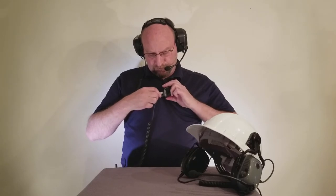Next we'll discuss radio mode. Boom mic placement is important for clear two-way radio communications. Press and hold the inline PTT button firmly to transmit audio and speak clearly into the headset boom mic. You should hear a transmit go-ahead tone in your ear indicating it is okay to speak — speaking prior to hearing the go-ahead tone will result in an incomplete transmission. Release the PTT button to end the transmission and go into receive mode. To change the volume of the two-way radio communications, use the two-way radio volume control on the radio. To power down the headset, turn off the radio via the radio's on/off switch or disconnect the cable from the bottom of the inline PTT switch Hirose connector.